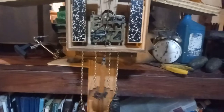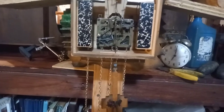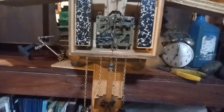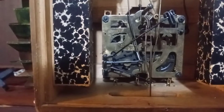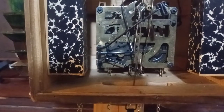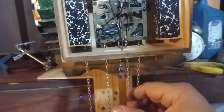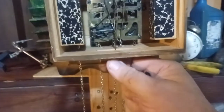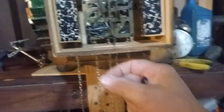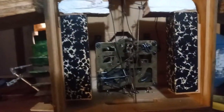The clock needs to have that open space to allow it to continue to run. The escapement wheel is already messing up. The clock will not run that way. I stopped the pendulum leader wire, and when I let it go it doesn't continue to tick. Let me go ahead and adjust it again — the clock will not run with that wire bent the way it is.